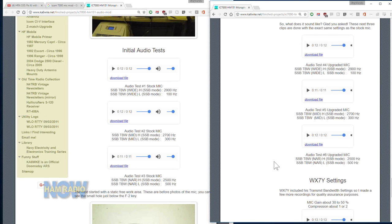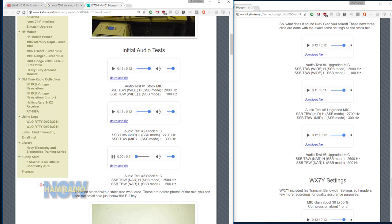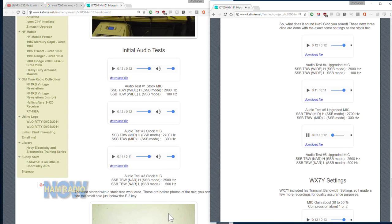We'll do the same thing with mid — back to back unmodified and modified mid. K6WKE audio test with stock HM-151 microphone, default settings, transmit bandwidth set to mid. Then with the modified HM-151, transmit bandwidth mid. Listening to his mid settings, the unmodified mic sounds definitely hollow, and the modified mic doesn't sound nearly so hollow — sounds a little louder too. It's an improvement; it still doesn't sound great in mid but it sounds better. Let's listen to narrow — both definitely have a tin-can sound.